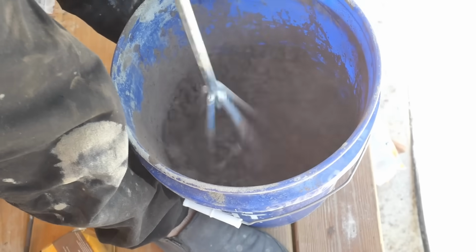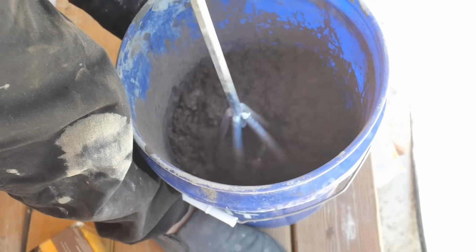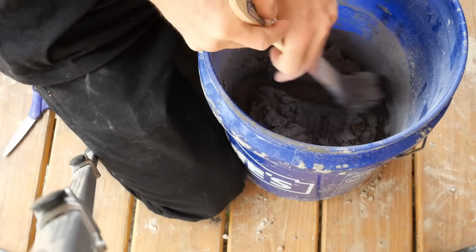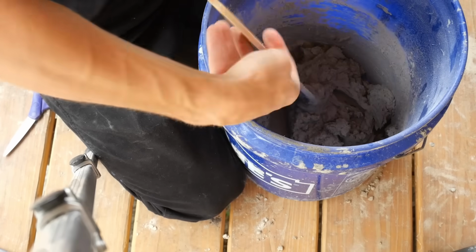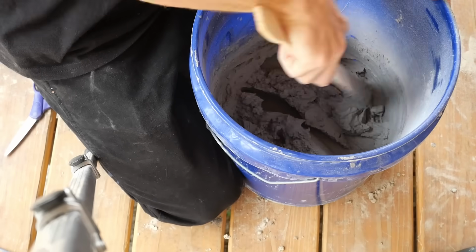They said in the email that you probably mixed it with a high-speed mixer, and if you whip too much air into the mix, it sets up very fast. That answered all my questions. The difference between the first job and the second job: the first job, I mixed it by hand with a paint stick, a very slow hand mix. This one, we mixed it with our drill on high speed and just mixed it for a while too, and even came back to mix a little more water in. Overmixing is what ruined our tile job.